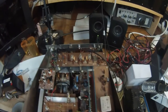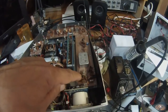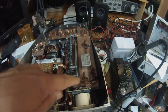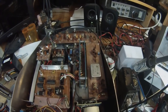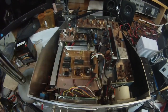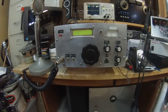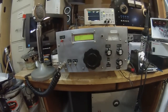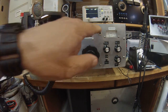The IRF510 is in the back. This is the bandpass filter on the transmit side. Wes put a really bulletproof stage in there. There's actually a separate crystal right here for CW, so that you pump a CW signal through at the IF frequency — you're actually producing real CW. This is the EI9GQ VFO stabilizer. You'll notice the stabilizer is really holding that frequency tight — it's not moving. I'll take that off and we'll see how much it drifts.